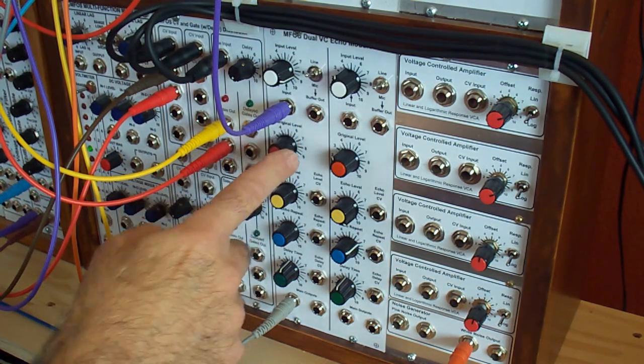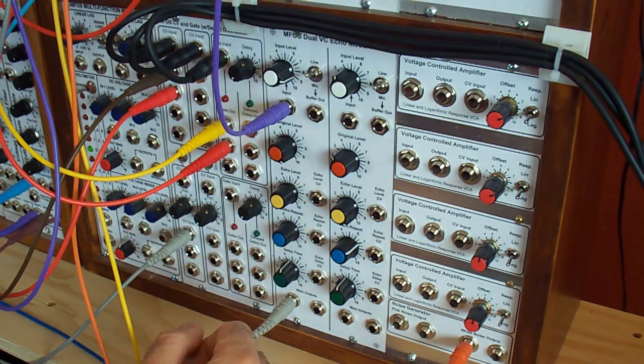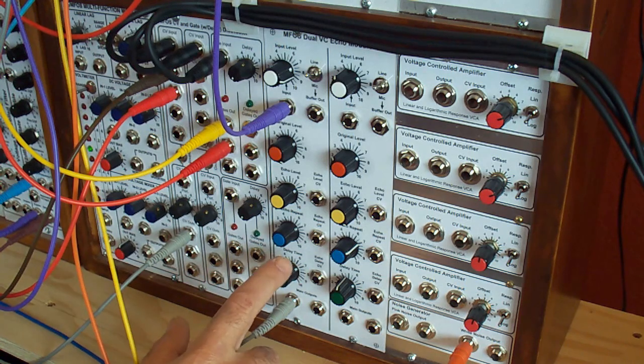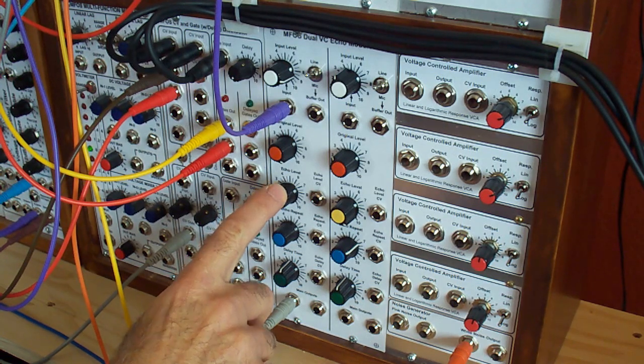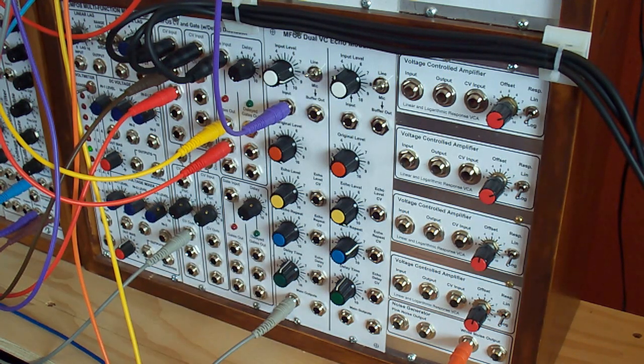We've got original level for the echo, we've got the echo level, and that's voltage controlled. So you can control the level of the echo with an external control voltage. Minus five volts to plus five volts is basically the range, but you can go further either way. If you go lower in voltage, you'll get longer delay times, but they will also have more noise. The way this chip works with Sigma Delta modulation, it's a one-bit system essentially, and when the clock times are too low, you start to get a lot of noise from the edges of the samples. I made it so you can go that low because it's kind of a neat sonic effect. By putting voltage in here you can get the same effect as the echo repeat, and voltage in here gives you the same effect as the echo delay.